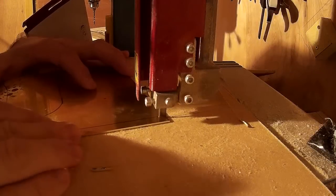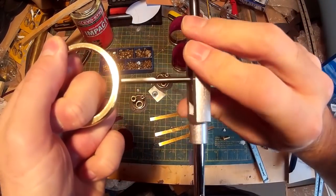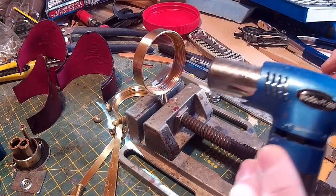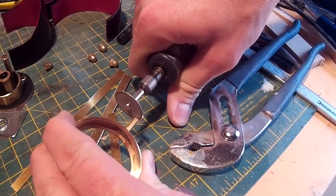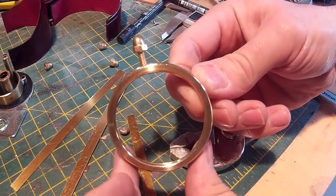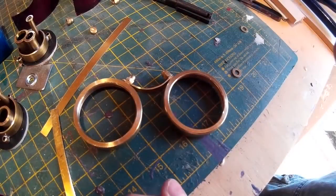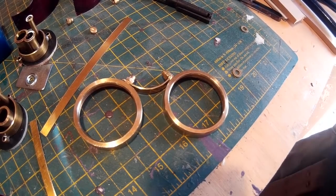I'm cutting strips of brass sheet on the bandsaw. I'm now drilling a hole into the top of the brass bush and using a tapping wrench to cut a screw thread into the hole — this will allow me to screw a bolt into the top of the brass bush. In order to secure it in place I'm going to solder it rather than glue it, which adds a more secure join so I don't have to worry about it coming apart. I'm using a Dremel to cut off the head of the bolt, so I've now got a screw thread coming out the top of the brass bush which will be capped with an acorn nut. I need to work out the correct length of brass to use for the bridge piece — this stuff's thin enough to be curved by hand, so I'm literally just running it along the edge of the brass bush to get a nice curve. I've drilled a few holes, rounded off the edges, and trimmed the screw thread so the acorn nut sits nice and flush, and I think that looks pretty good.